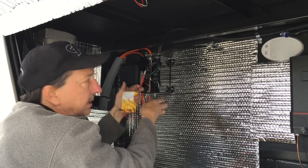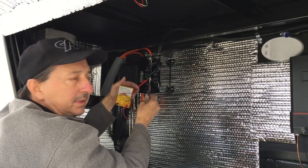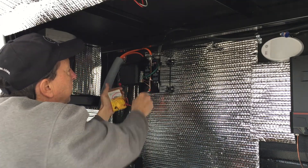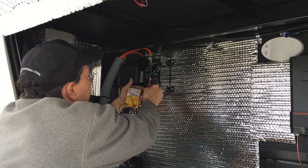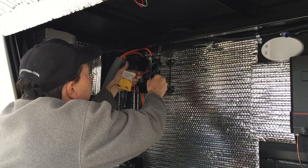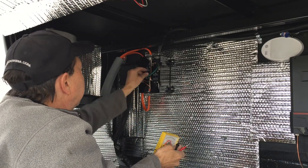Passing through now — got 110 that way, got 110 all the way through. There's a loop at the bottom so this should be 110, but it shouldn't be passing all the way back through to the inverter. And it's not — so that's perfect.